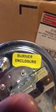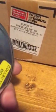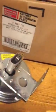When the furnace exhaust blower comes on, it sucks through here and closes these contacts. One is normally open and one is normally closed. The other function is a pressure safety: if there is backward pressure, it's going to open up the switch — that's a safety feature.